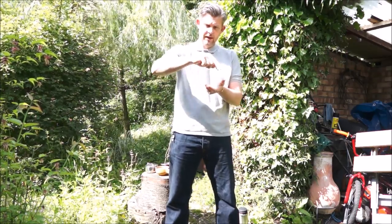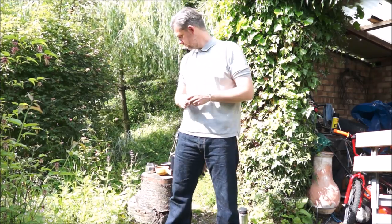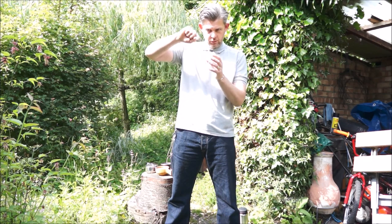So when you are actually carving the bowl out, you can see if any splits are coming out around the outside, and then cut it off when you're sure, because you've always got that bit of movement. So always make sure that it's slightly larger, maybe an inch either side, or longer. Plus it's easier to hold when you're carving out the bowl. Then let it sit for a day, see any more cracks appear, because when you cut it, it may look fine, but then within hours or days, little cracks will appear. So it's worth leaving it for a day, see how it settles.